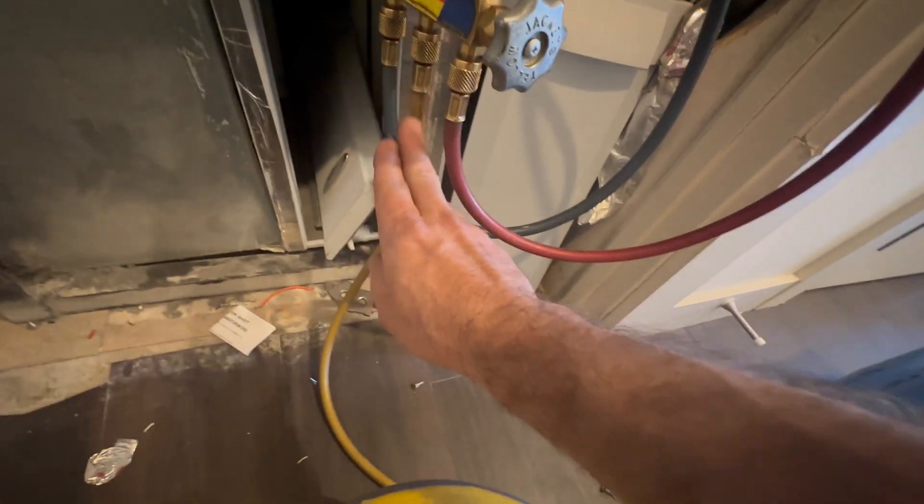I did miss a braze on the backside, which I knew was going to be hard to get to. Let's try again. My original thought was to remove this panel so I could access the backside — there's a custom return vent built in and I was trying to disassemble it. It was taking too long so I just gave up. This is why I'm doing it in place and why I added the couplings, because I knew the backside was going to be hard to braze. I missed it big time.